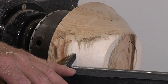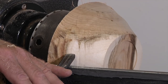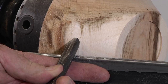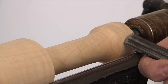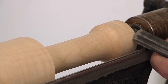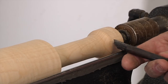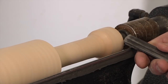So that's pretty much basically what you can do with these on bowls, which is all pretty standard. You can do the same things with gouges too, but I just like this fluteless gouge better because you can roll this up to a really high shear angle. It just makes the wood come off a lot easier with a lot less stress, a lot less pull. So this is a fish whacker, a bonker, a carver's mallet, a potato masher, or a sauerkraut pounder. I found out these work very well on spindle grain orientation. One of the things I have no idea why it works — you cannot do this one with a skew. You cannot start to cut on the edge and go in; you always have to go off. And I am guessing that has more to do with the blunt angle on it.